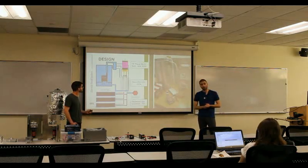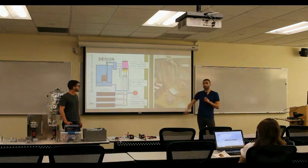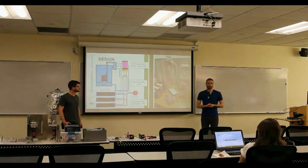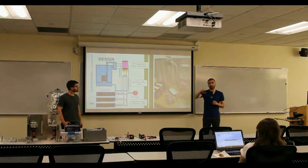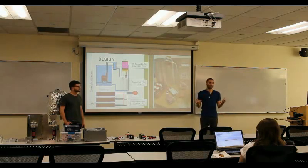The Swordfish is the electronic speed controller — it gives the motor a firing schedule, turning the poles on and off at a certain rotation. It was selected because it's programmable, but the system doesn't give you much programming. The way it's controlled is via an Arduino and a shield soldered together with a knob. The batteries are lithium polymer, 5,000 milliamp-hour each. Three of them are wired in parallel, giving plenty of energy to run one pump. In theory, running both simultaneously would require another full set of batteries — we never got to that point, so we just traded off the power components between pumps.